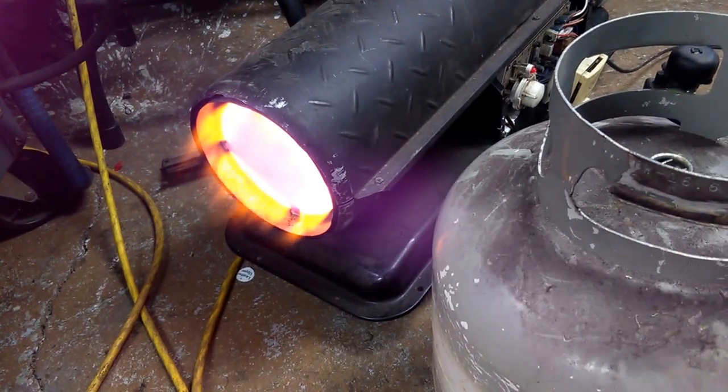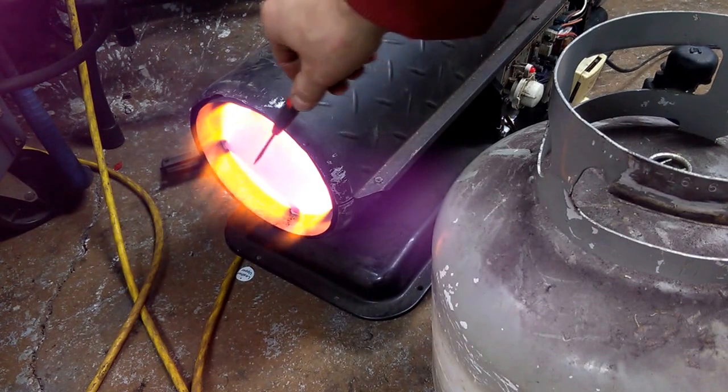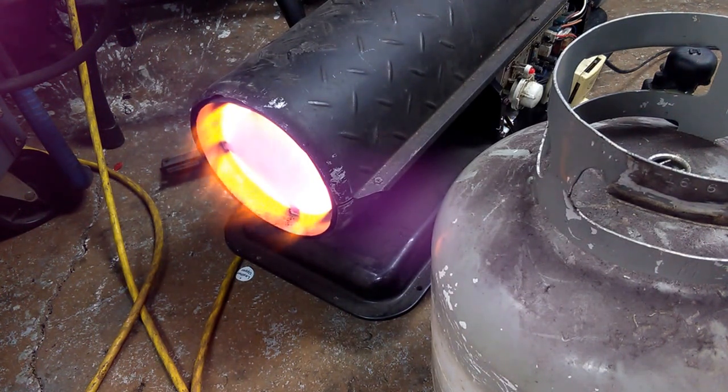It's a lot more yellow in the video — it's quite a bit more orange on the front cone in person. The only downfall of this is I've got to run it at a lot higher pressure and higher temperature to keep that oil burning in there enough to keep the flame sensor from tripping off.